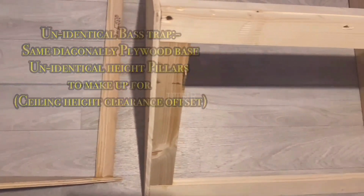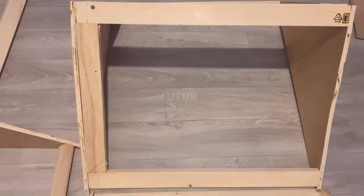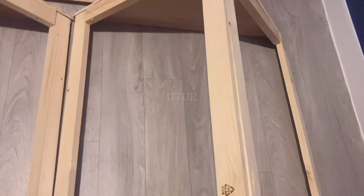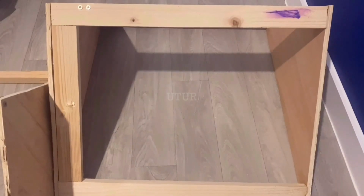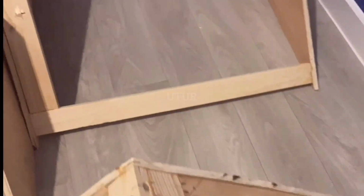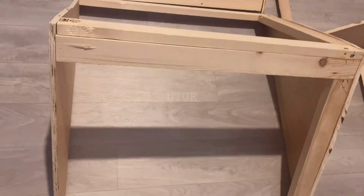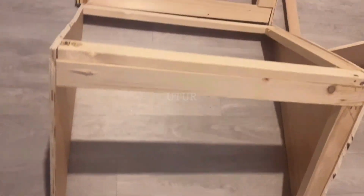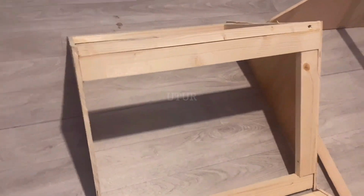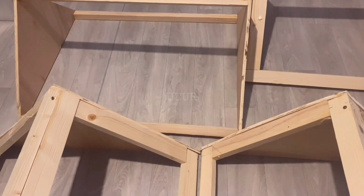It's got a different height and only 3 pillars supporting the housing frame, which is subject to reinforcements, whilst the other 3 housings are identical, with a number of pillars supporting both the top and bottom plywood structures. So here, I will be visually inspecting the top level assembled housing structure with their respective bases to make sure they are as per the design review, okay? And so far, there's been no bottlenecks, concessions, or non-conformance.